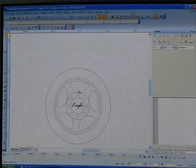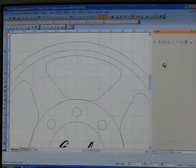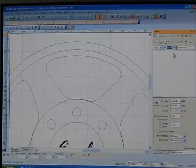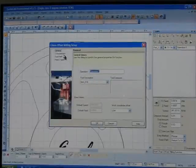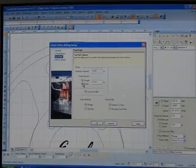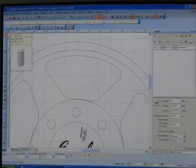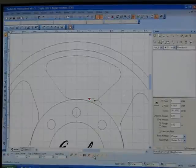Now I need to draw it up in TurboCAD, which you'll see here in a second — and there it is in TurboCAD. This shows how TurboCAD works. I'm choosing a half-inch ball end mill right there, and I've already set all these settings so I'm just going through the motions. I'm going to change the feed right here, and then we're ready to start. You can choose a line that you've made and it will follow it with the end mill. Right here I'm making the lead-in and lead-outs for when you're milling with the end mill.